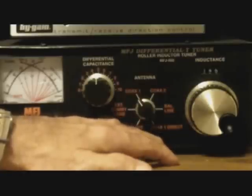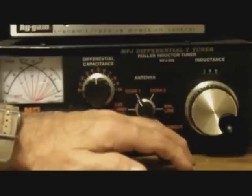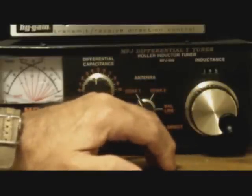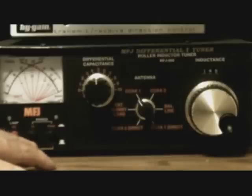If you know the antenna is tuned perfectly, you can just switch over to coax-1 or coax-2 — it has two plug-ins on the back for two antennas — and completely bypass the tuner. There's also a lamp light, which I never use, a peak reading or average indicator, and a button in the middle for high power or low power. I usually tune in the low power setting.